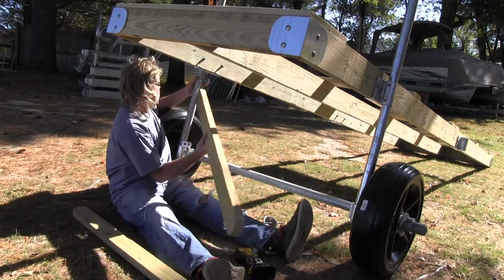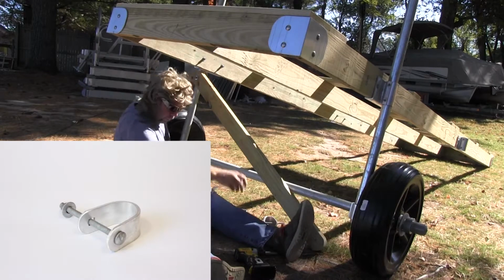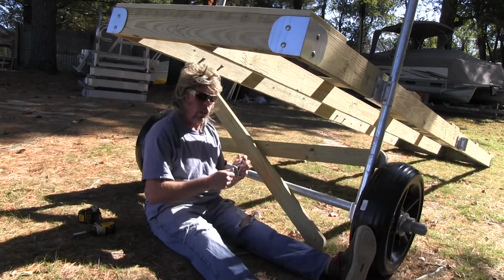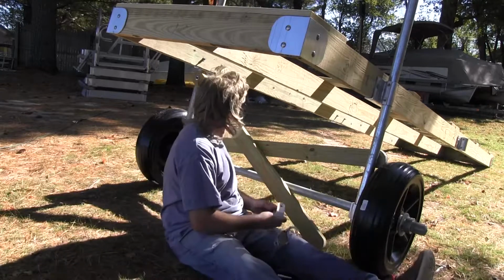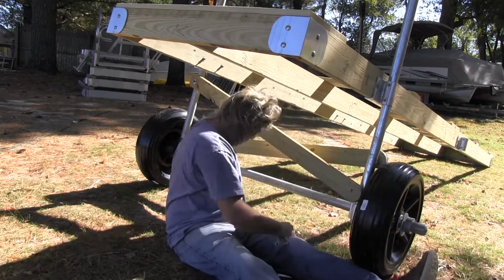The 2x4 braces will be held onto your dock legs using the part number 9149A, the 2x4 brace clamp. Remove the nut and washer from the carriage bolt, take the carriage bolt out, put the clamp around the pipe, put the carriage bolt back through the clamp and through the 2x4, and then reinstall the nut and washer. Tighten it up and this will secure the brace in place.